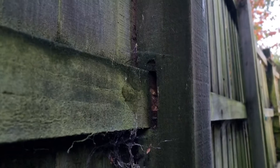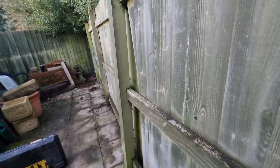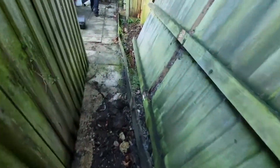First things first, what you want to do is get your crowbar in there and tap these nails out and pop these posts out. They're just released because they're rotten on the bottom — it's snapped off. So just taking this really long heavy panel out.